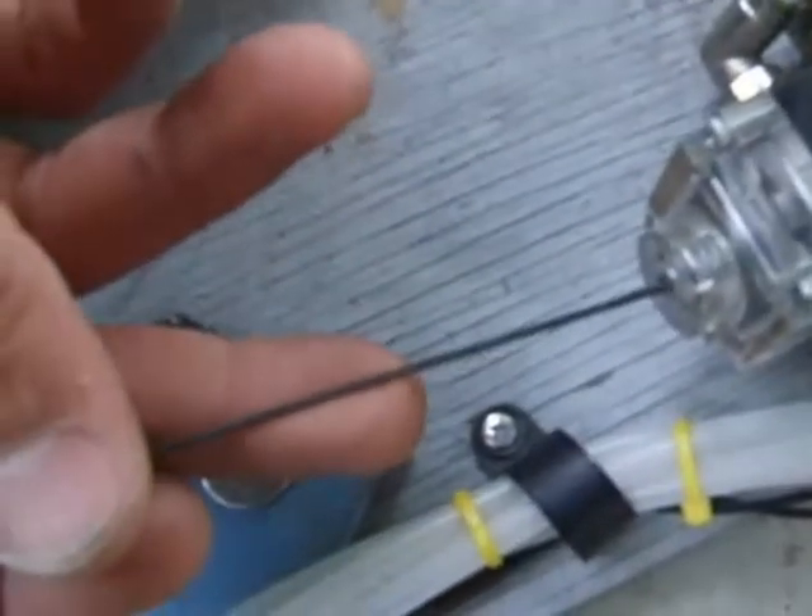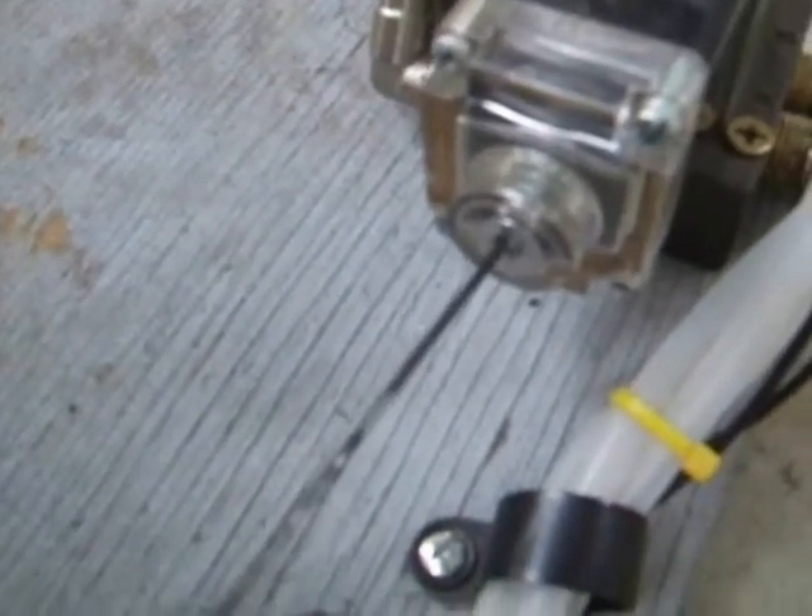The reason why it's good to check with manual overrides is sometimes you have electrical problems and you don't know, or you don't know if it's electrical or air. These manual valves are great because you just push in and the whole thing will move over. This other one here is the left side-to-side.